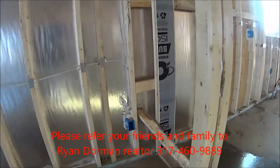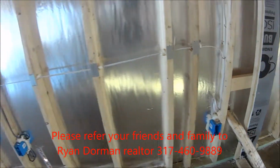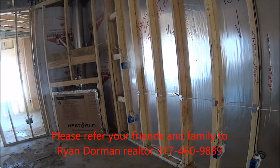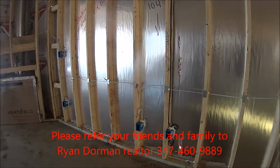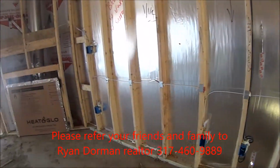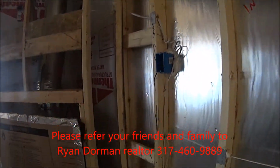And again, when they install that outlet, it will be turned upside down compared to the other ones, and the top one will be controlled by the switch. The bottom one will be hot all the time. And then you've got a TV and phone hookup over here on this wall. You got a light switch for the 2 lights here in front of your fireplace.